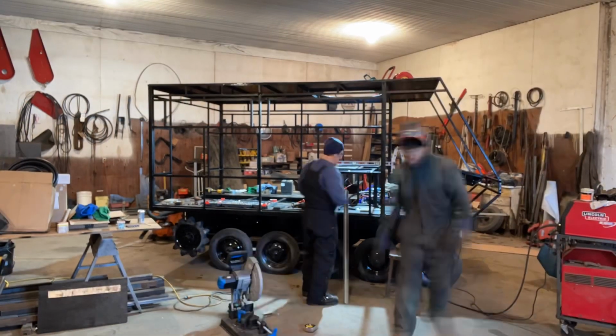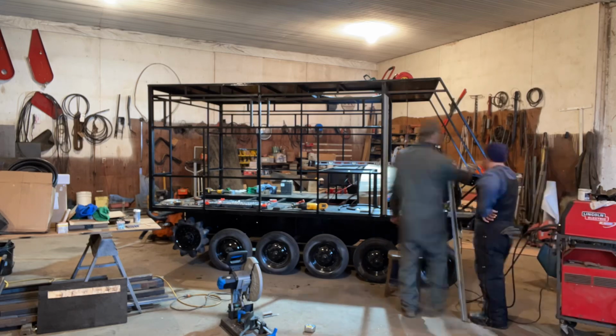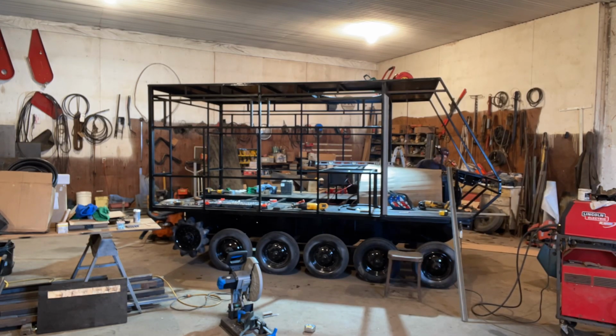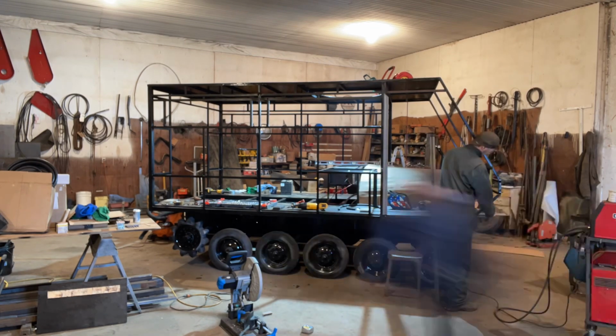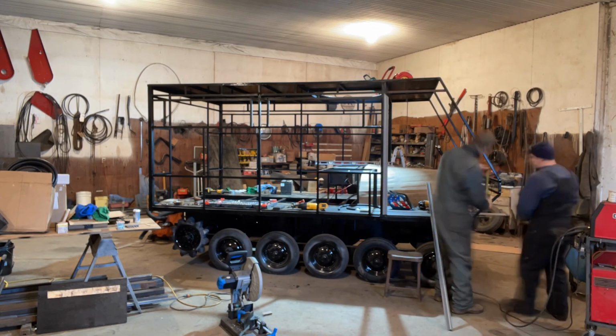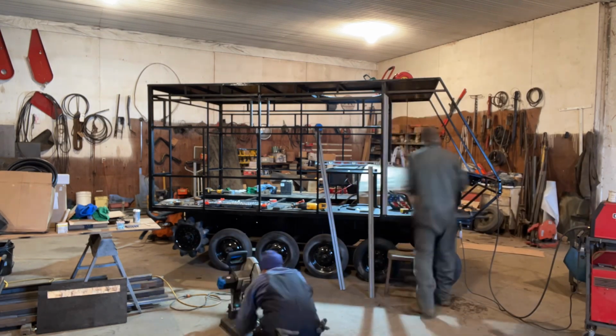So I think we're going to call it Z channel. It's 1 inch by 1 inch by 1 inch. And even though that's symmetrical, when you're cutting 45s in these to make sure that everything lines up real precise and gives it a nice fit and finish, you really only get one chance to make a good cut.